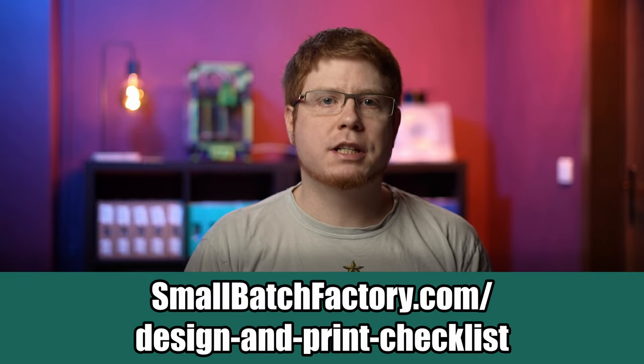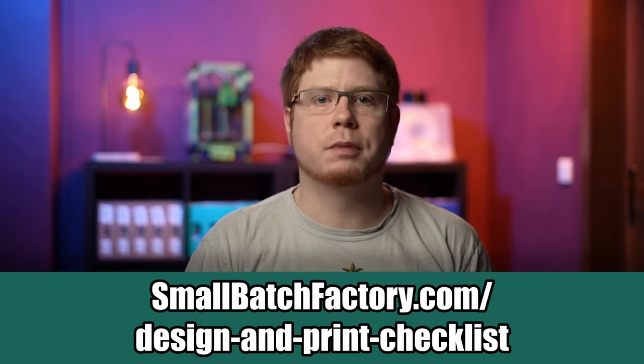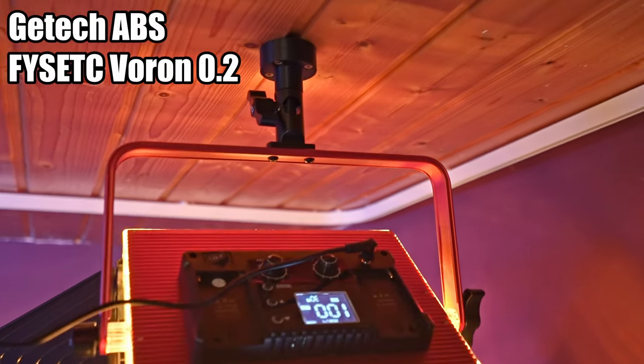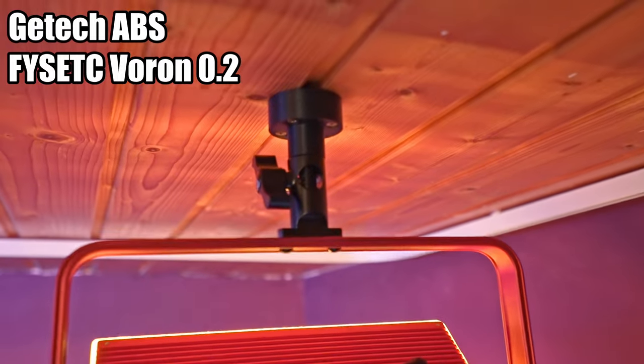In case you want to make sure a part can withstand as much load as possible, you can combine it with metal hardware where possible. I explain that concept in more detail in my free design and print guide — download it with the link in the description below. And thanks for applying some solid infill to the like button while you're at it. Combining metal hardware with printed parts results in virtually indestructible parts — I do that quite often. Even my studio lights are held up with metal-reinforced holders.